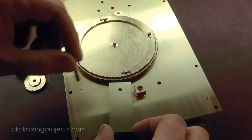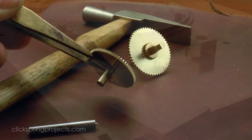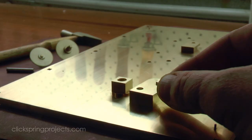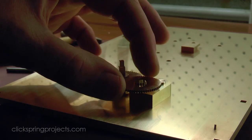The temporary version of the H arbor means that the HI pivot block can be used in a similar manner. A small pin ensures that it pivots from the Exeligmos position, and the block can then sweep over the surface of the main plate to find the correct depth of engagement for the H assembly. Again, removing the risk of the Saros pointer bearing being poorly positioned when filing the square.